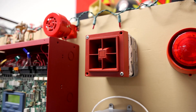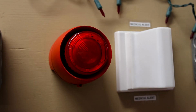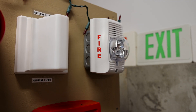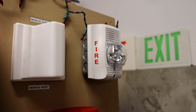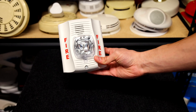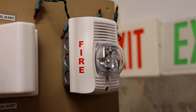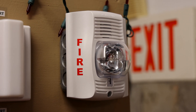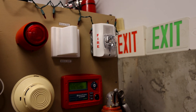It is set on Temporal 3. These two devices you got to already see earlier. And then this right here is a System Sensor Spectral Alert Advance CHSW Chime Strobe — that's right, it's that new chime that I unboxed. I have it set on its whoop tone, and we will change it to a different tone later on in the test. It's a pretty interesting tone to hear out of a Spectral Alert Advance, so I figured we'd start off with that tone and then change it to something else later on.